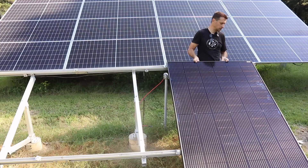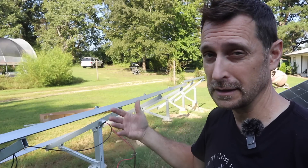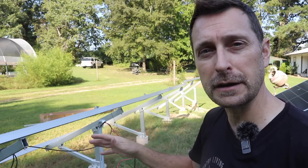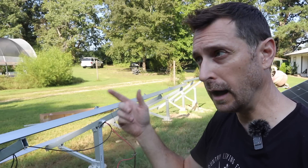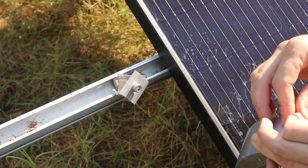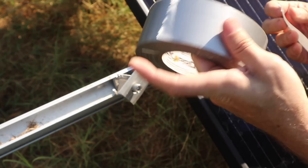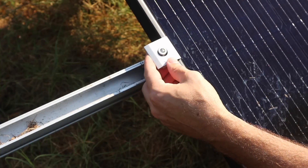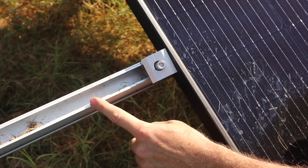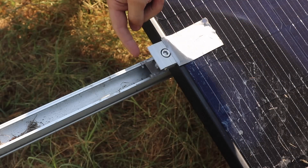Aluminum scraping on aluminum is like nails on a chalkboard. We don't have any reflective surface underneath where our new panels are going to go because I didn't have bifacials before. I will be adding a layer of rock or something white colored and reflective to see how we can boost up the power on those panels. Here's a little trick when putting panels on by yourself with a middle clip between two panels: use duct tape. Tape the clip to the top of the panel so it doesn't fall, and then you can slide the other panel right underneath.